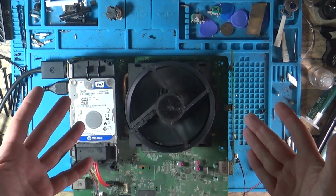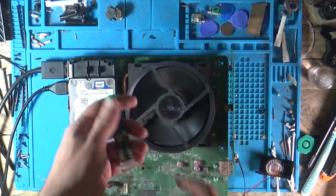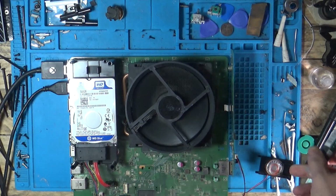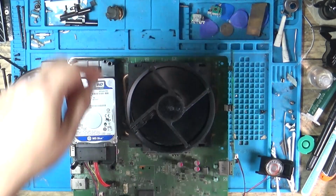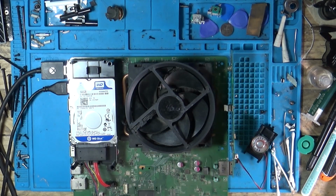Obviously, there's no way I could set up this. I'll probably put some more conformal coating on there, some of the solder mask, just round that wire, just to double insulate it, double protect it, because it is touching the ground on the other side. But yeah, I gotta do that. And we'll put it all back together. Let's give this a clean up and put it back together.